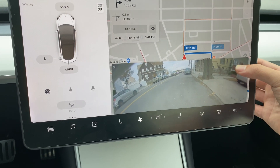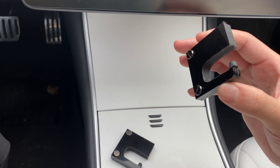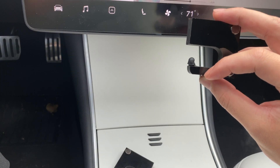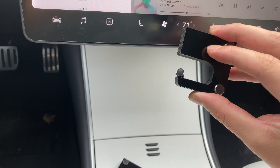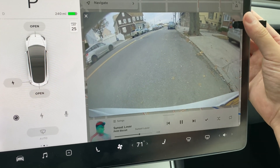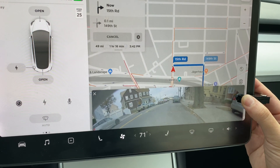I refined the design and this is what I came up with. It's just 3 pieces of laser-cut acrylic, there's a rubber capacitive stylus tip attached to a wire — a 30-gauge wire that's hidden in here — to emulate the capacitance of your finger. The way it works is you just clip it onto the side of the screen and you can leave it in any position and it'll just hold it there.